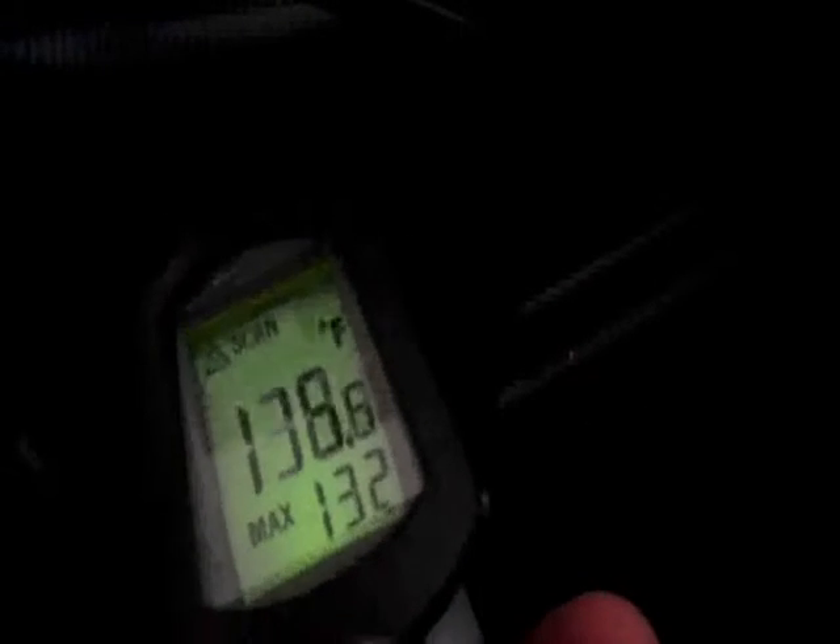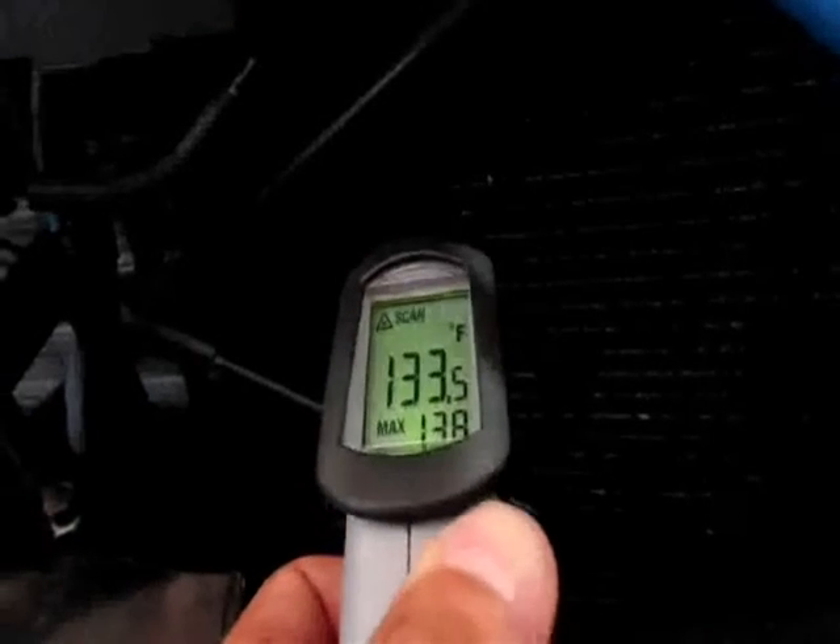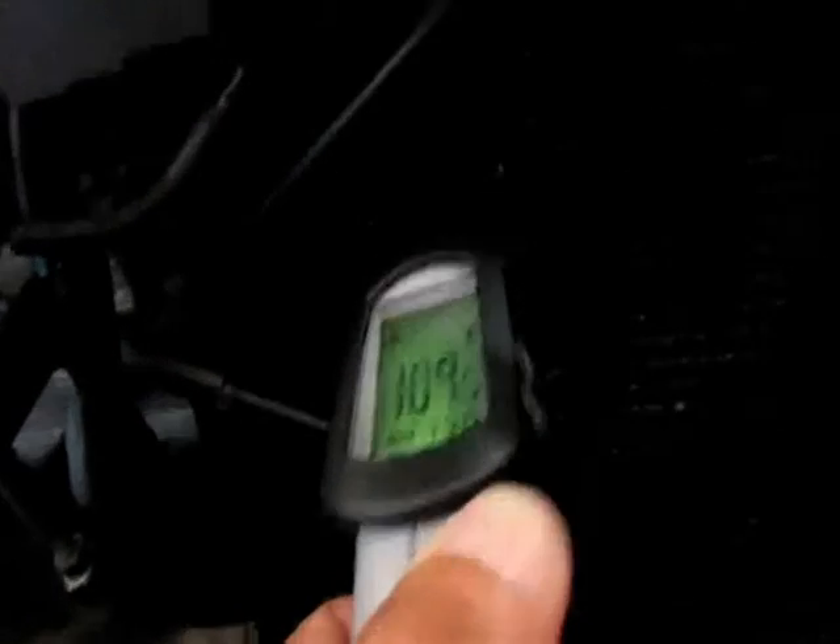Over time they still go bad and should be replaced, but I think this one's salvageable for what it is. The lines come in from this direction so you have flow going into here. Looking at the readings — 111, just about 10 degrees difference, not much. It could also be where the fan is, since it is cooler down here. I think the fan is sucking more air into the center, so that could be my reasoning too. Obviously the fan moving air will make it a little cooler than on top where it isn't.